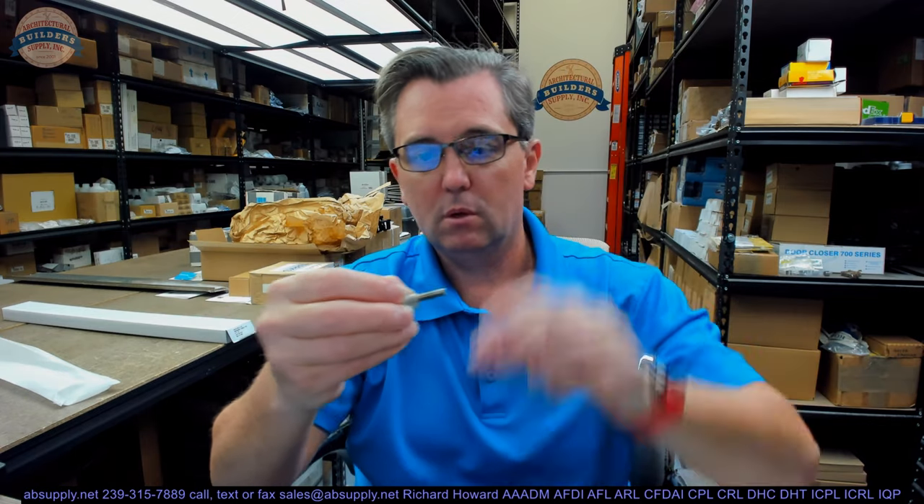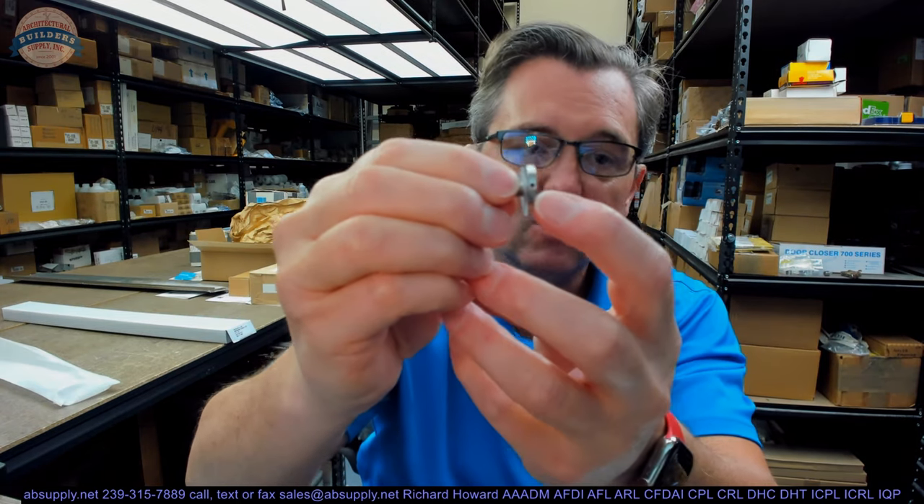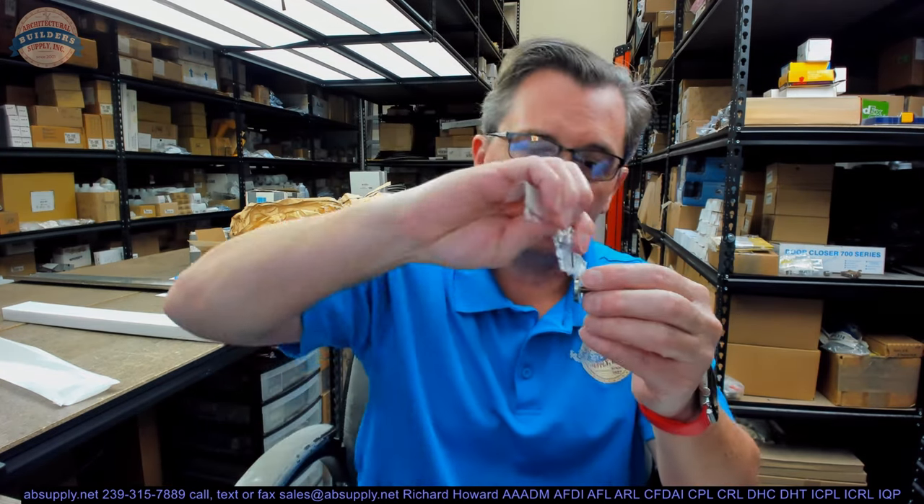Let's talk about the mounting package. You're going to get a couple of washers, one bushing, and your bolt from the inside. There's a small black dot — that's actually a very small hole into which you can insert the tool, which is nothing other than a tiny Allen wrench, so that it will act as a spanner wrench. A spanner wrench allows you to get something hooked onto the circular edge and rotate it loose or tight. You can get it stuck in there and give it that final couple of very small turns — whatever you can't do with the tip of your fingers.